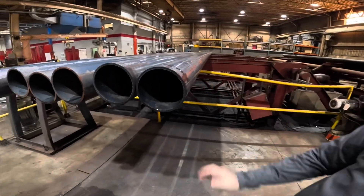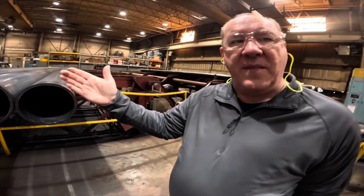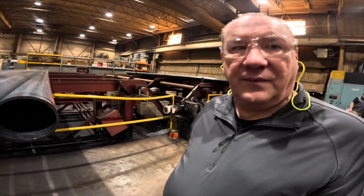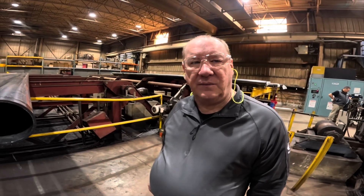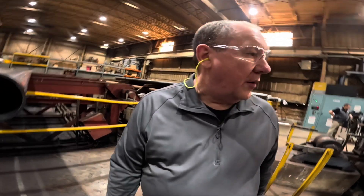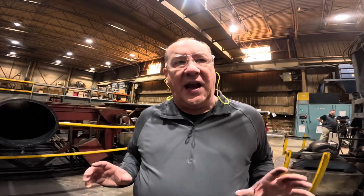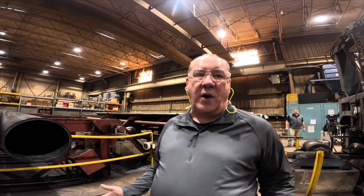That's the pipe we just made — just heat treated. If we were using non-heat-treated pipe, it's the same pipe with the same chemistry, we just don't heat treat it. On a hardness scale, heat treated comes out around 57 HRC, and before heat treating it would be in the 30s — so it essentially doubles the hardness. It more than doubles the life of the product. That's why if people aren't taking care of their reducers or elbows, they should be buying heat treated — it lasts a lot longer, pressure rating is higher, and it's stronger overall. Heat treated pipe is not double the cost but it'll more than double the service life.